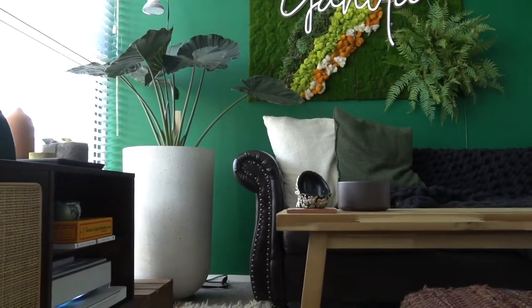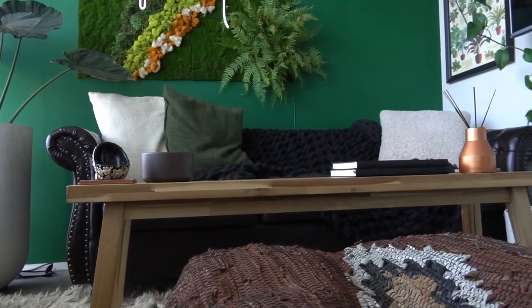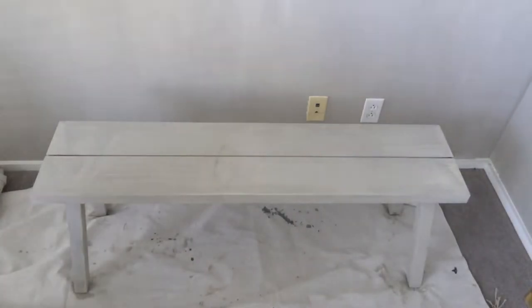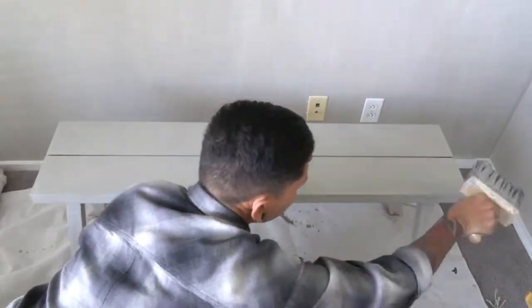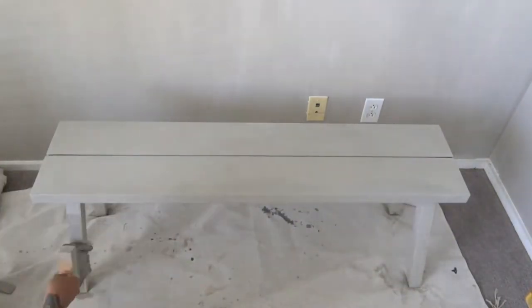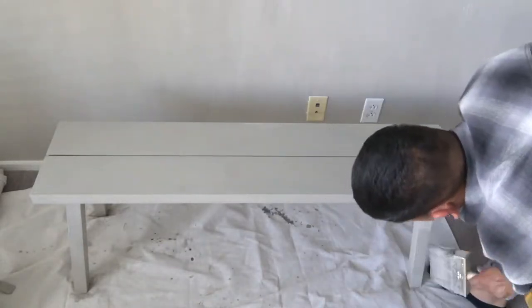Up first on our furniture flips is the bench. You can see in the previous boho style how those natural warm tones helped bring in that warmness that boho typically has. When attacking this in the flip, I wanted to create a monochromatic look using the lime wash paint. This is the IKEA Skogsta bench — roughly around $100 — available on their website or at your local store. I applied one coat of primer and about two coats of lime wash, following the same techniques as the walls, so it blended really easily into them.